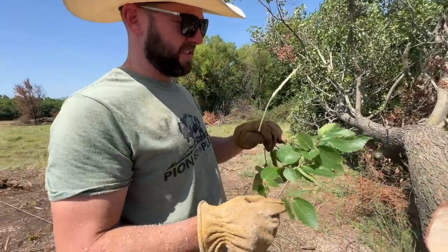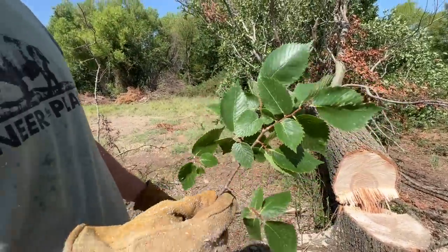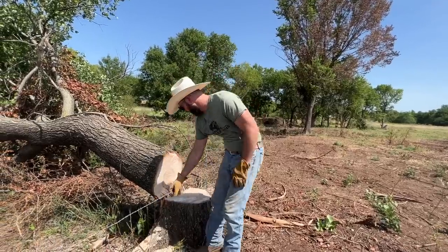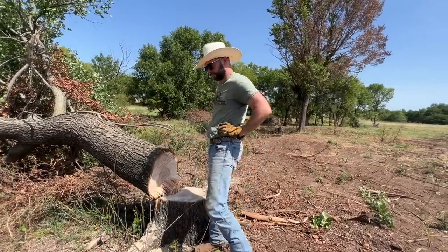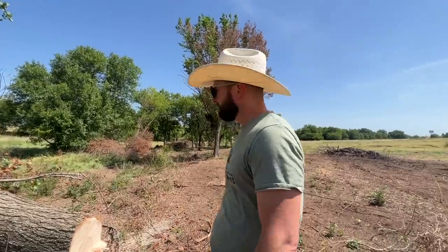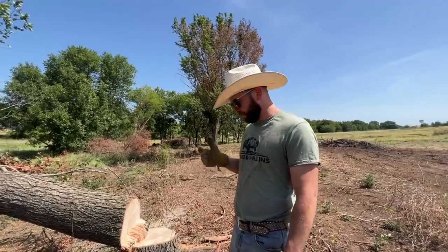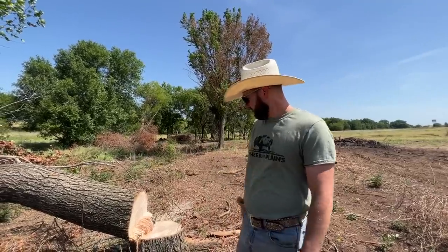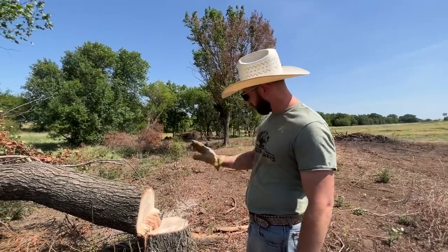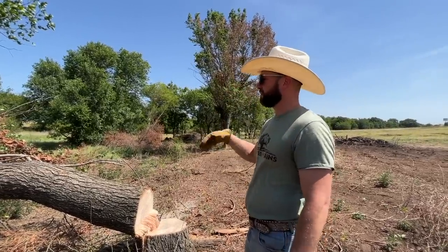Maybe another tree, I'm not sure. It's a pretty good tree. At least it's out of the way now. This first line will be pretty close up here anyways, so that'll work out. At least you do the first line about 16 inches. It's where we like to put the first line, especially if you're only doing five wires. If you're doing six, you may have to go a little bit lower, but 15, 16 inch tall range, that's about right. So if I need to carve more out, I can, but as long as we spray it, barbed wire can hit right. Yeah, there you go, done.